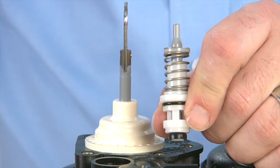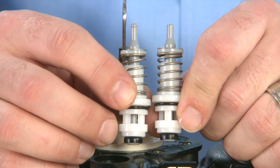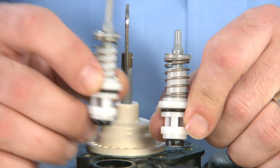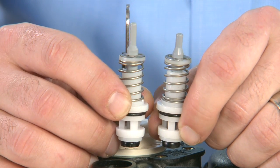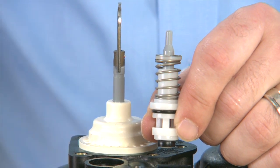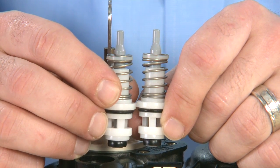Make note, there are different lengths of brine valves, such as this unit for our 9000 valve, or this unit such as the one used in our 7000 — these are of a longer length. So make sure when you are replacing, you get the correct part of the correct length.